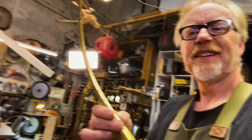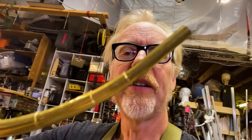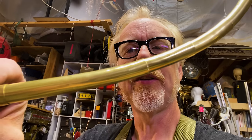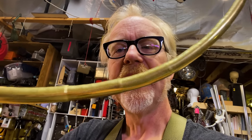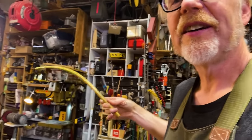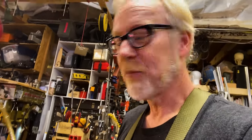I have my spout. Look at that. Isn't that lovely? Tapered. And all I did to do this was slowly bend pieces of brass tubing and then cut out just the bend part using my portable bandsaw and then thread them all together. So you can see the steps quite clearly here, but from here, it just looks like a nice, delicate flower watering can spout. I am super happy with that.